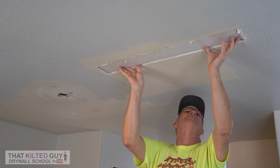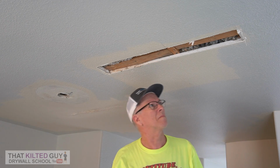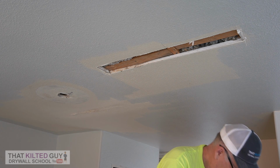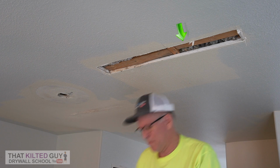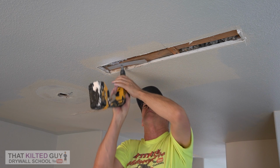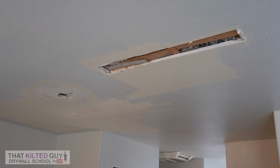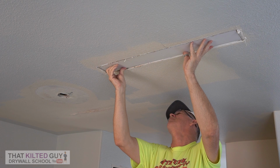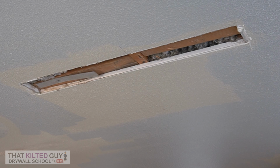Sometimes on these kinds of repairs, even though the sheetrock is 1/2 inch, the 1/2 inch sheetrock will go in too deep, partly because there's often a little extra thickness of mud around the edges where the inside angles were taped. So I ended up putting a shim in, as you can see, and sometimes you just keep playing with 1 shim, 2 shims, etc. until you get the new piece to ride just barely below the old piece. You don't want it to ride above at all, so it's better to be a 32nd below or something.